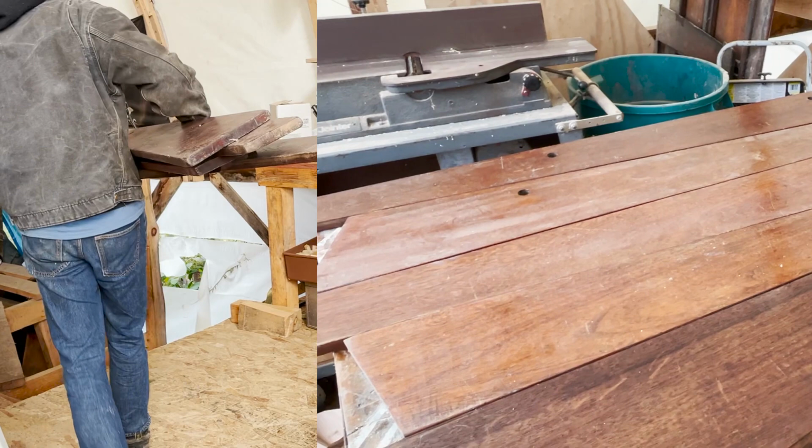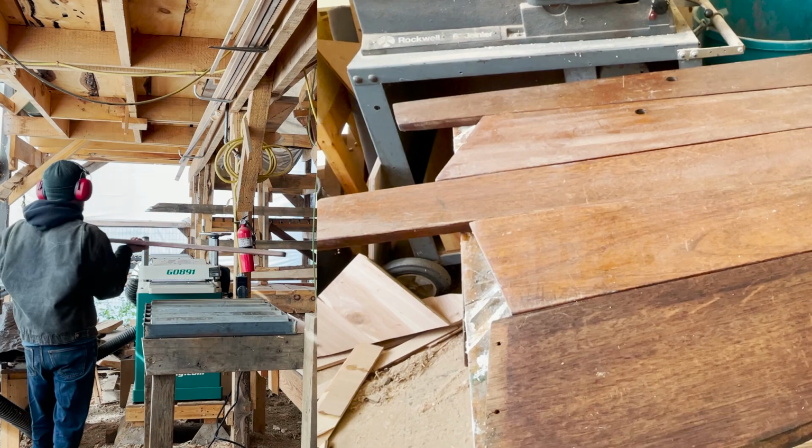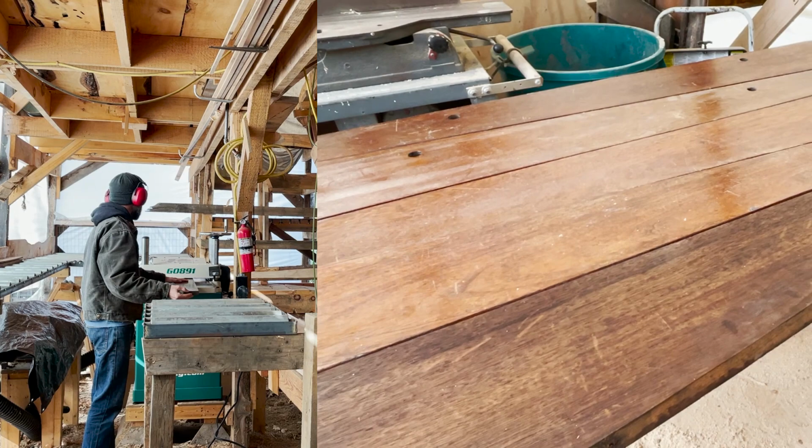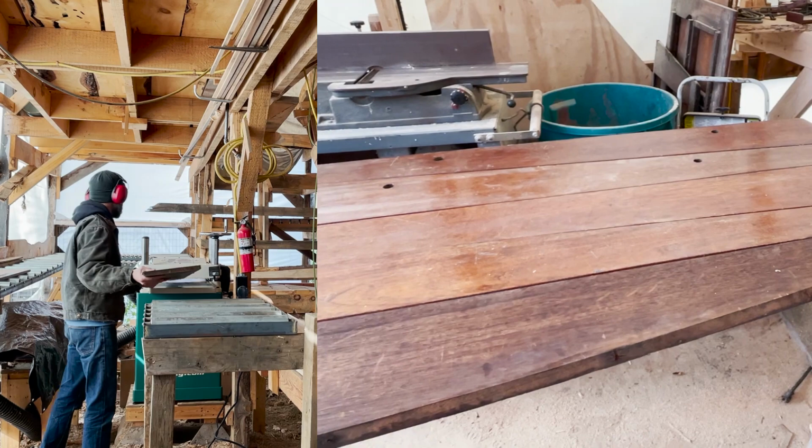So we're gonna use cedar and homemade plywood for that. And these are gonna get cleaned up and get glued together and become the nav table. So I'm gonna take these downstairs and run them through the brand spanking new thickness planer and just take a skosh off each side. I just wanna get the finish off them, get them a little flatter. Some of them have a tiny little bit of cupping to it, and get them ready for glue up.